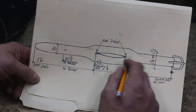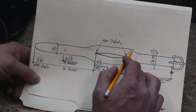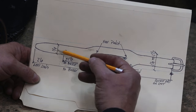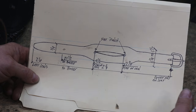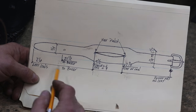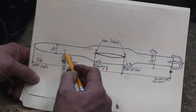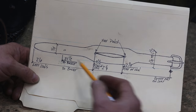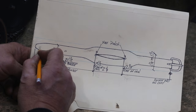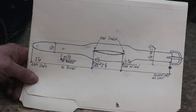The holes help keep the leather from ripping any further past the point where we cut it. We're going to make sure this is comfortable. Once we have the chin set and it's comfortable we'll trim it — cut out about a quarter of an inch of material on either side so we're left with a strap about three-quarters of an inch wide. That may seem a little wide, but as it gets used and as it gets sweat and everything else that's going to thin down and probably be closer to a half inch. The 21 and a half inches is about where the leather strap will be buckling to the buckle. I leave it long so it hangs down and it's easier to undo. I'll also pop a hole at the end of this so when you're getting ready to put it on, you put this hole on the buckle so you don't ever have to fumble doing that while it's on your head.